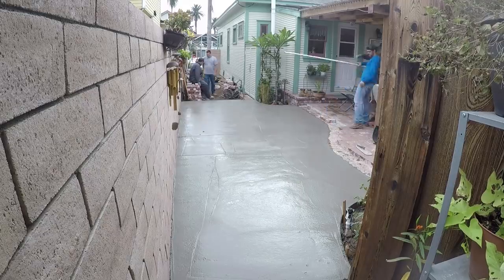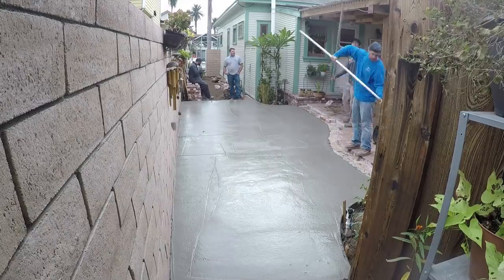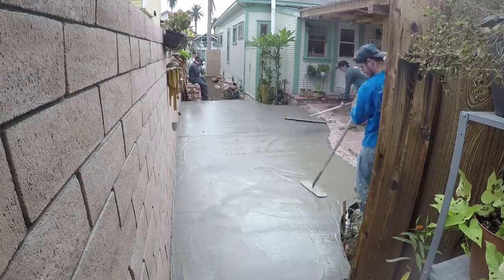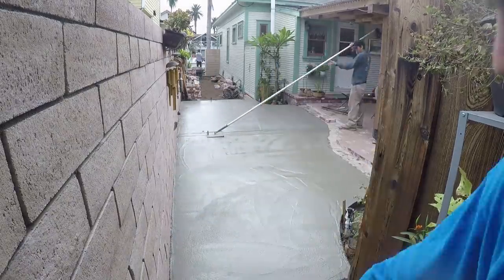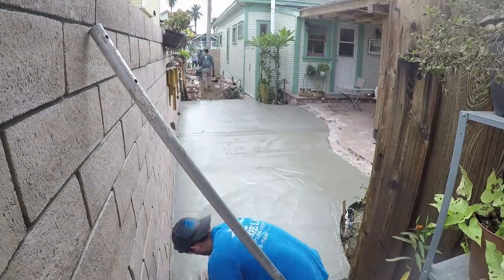I am putting one control line in here, and I'm going to line it up with the existing brick all the way back. That's going to end up being right in one of the joints of the brick going across, in between the basket weave pattern — so if it does crack, it won't crack through the brick; it'll crack in a mortar joint.